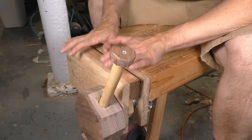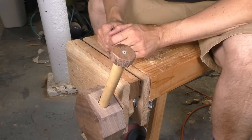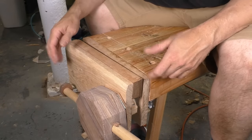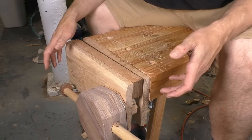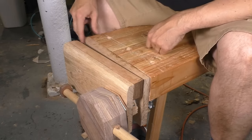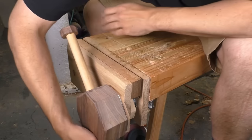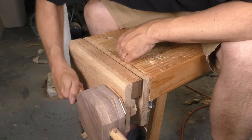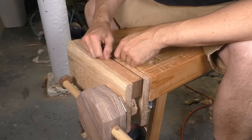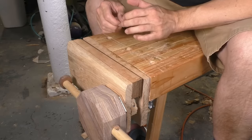So now you've got your vise installed on your bench and you're going to be super excited to try it out. Here's what's probably going to happen: you're going to start closing it and immediately think you don't like the way this thing works — and it's probably going to have a lot of problems. For instance, you can see this one is racking really badly — very wide opening here, very narrow opening over there — and it's really loose and floppy as I'm moving it around. It's very unsatisfying to use. Homemade vises like this just need a little bit of fine tuning to work really well.